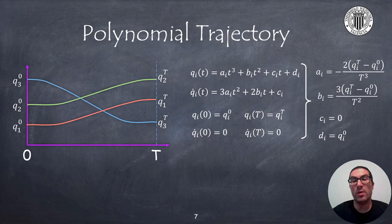Robot joints are controlled in position using an internal potentiometer; however, this is an individual control that may lead to inadequate behavior because we cannot control the overall time that they take to reach the desired position. If you want to implement a coordinated behavior — where t is the overall time of the trajectory described by all servos — then we can use a polynomial trajectory generator, allowing control not only of position but also indirectly of speed.